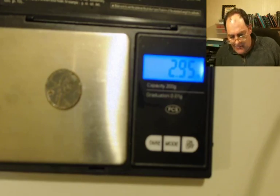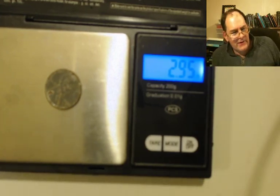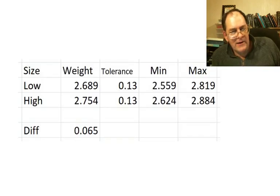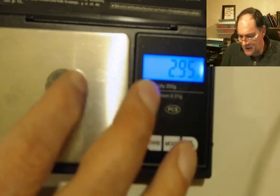Yeah, we're just going to keep on going. All right, 295. 295? Well, it's not supposed to be that big. What's the maximum possible size? It's 2.84. Well, that's actually a thick planchet then. If it's 295, I'm going to take that off.